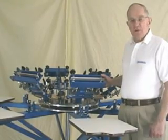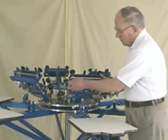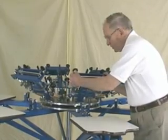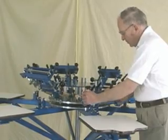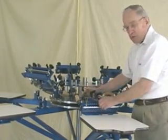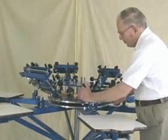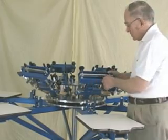When you get your machine together, you want to make sure it's tight. This collar arm should not rotate or flex in any way — it's very tight. But if yours flexes, at some point it pivots. At that pivot point, you want to see where the movement is and tighten as appropriate, so there is no flex on your machine.